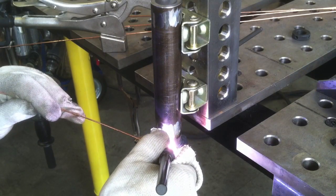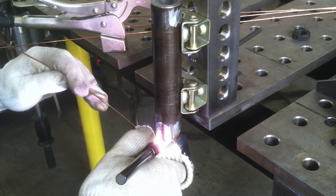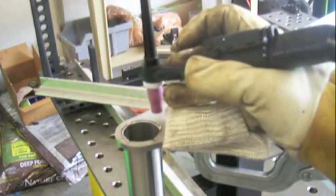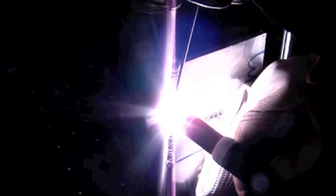Anywhere there's not a ready place to prop — right now I've got a light duty pair of cotton gloves on, but I slipped a TIG finger on one finger and I'm propping it right against the metal where the weld is, no problem. I'm doing a little stainless joint here, propping right next to the weld. It's just a little fusion weld, making tiny little circles, tying everything in. This weld didn't need much strength and didn't need any filler metal — just a quick, easy way to make a decent looking weld, using the corner of the inside of the tubing for filler, rolling it over with just enough heat.